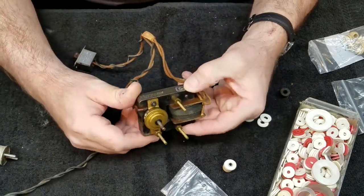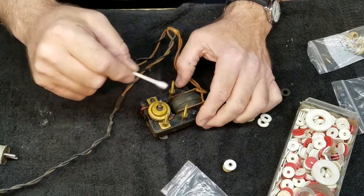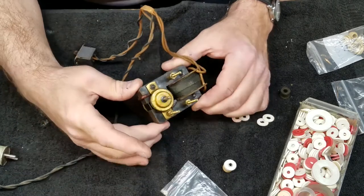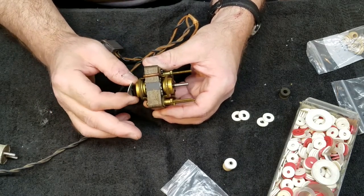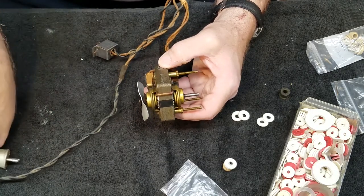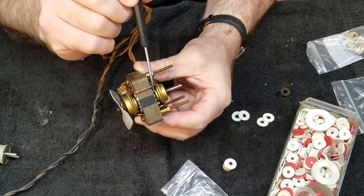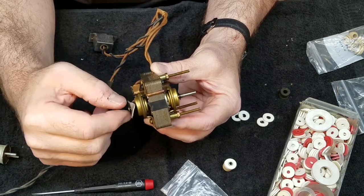It's time to do what I can with this motor. There's really not much that needs to be done. I've already cleaned the outside of it with some lacquer thinner, and that got everything looking better. It already turns freely, so I'm not terribly concerned about loosening anything up - I don't think there's any nasty grease in the bearings. All a motor really needs in this situation: if you look really close, you can see there are felt discs - like felt washers - that straddle the motor shaft, one on each end.